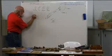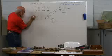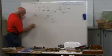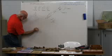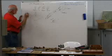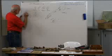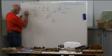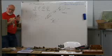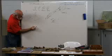So, here's our dividers. We've measured across there, and then we measure down across there, and on the back of the plate we make the two marks. Then we get a ball peen hammer, which is like that. We have a little ball on the end, and jewellers keep that all nice and shiny and polished, and you just tap lightly a series of little dints around that area.